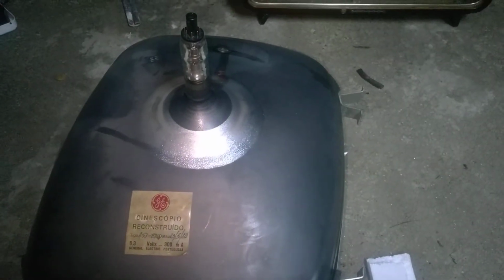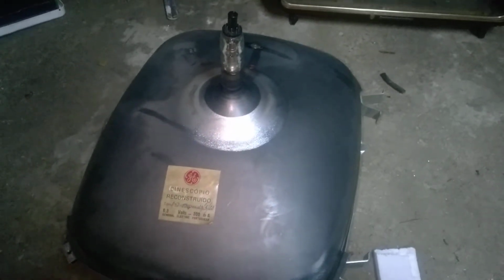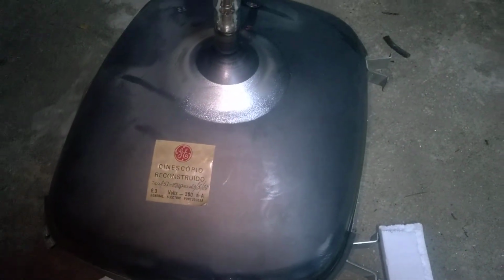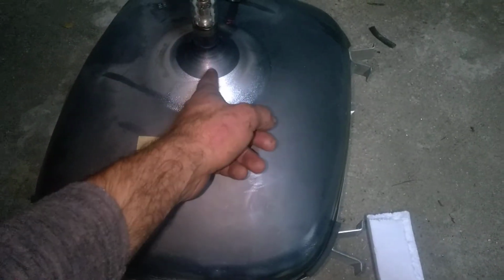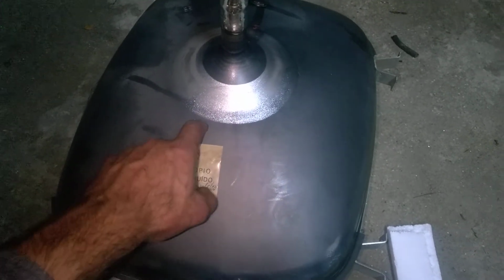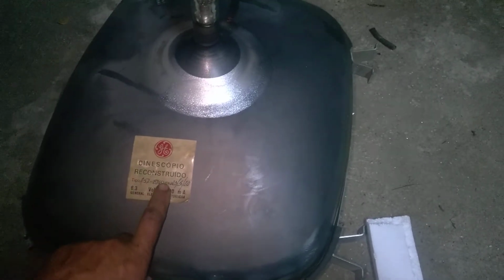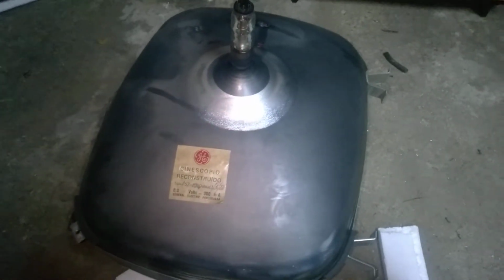And I spent weeks, maybe months, troubleshooting the AGC section, because this TV has a very complex AGC system. It even has a cool feature in which, in order to reduce the heating hum, which means weird stuff on the screen and weird stuff on the speaker when the TV is warming, they rectify the voltage on one of the heaters, on the heater string. They extract the negative part of that voltage, and they feed that into the tuner in order to block the tuner from working. Once the horizontal warms up and the boost voltage is developed, the boost voltage contradicts that negative voltage and the tuner starts working only after the horizontal is working. So lots of cool and complicated weird stuff in the circuitry of those nice televisions.